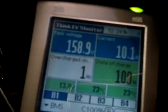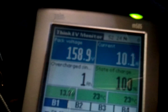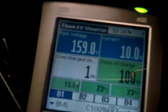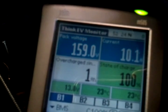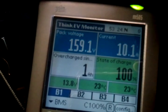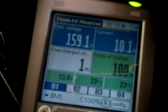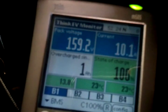There are a couple more points — to monitor the temperatures and make sure the batteries don't get too warm. Basically now we need to wait. There are going to be 50 amp hours put into the battery, and it is important that I'm here when those 50 amp hours are charged. The current being used is 10 amps, which means the maintenance charge should be ready in about 5 hours. The charging can stop if the battery temperature gets too high or other conditions arise, and then continue — so it could be longer than 5 hours, but 5 hours is the minimum.